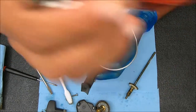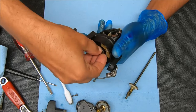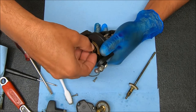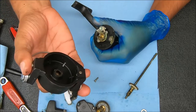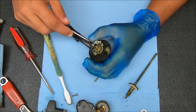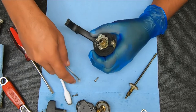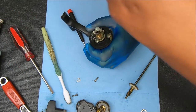Alright, so let's go ahead and remove this rotor and see what's going on under there. Even though I looked at that gear and said it looked alright, you can't always tell — but it did look alright there. So I'm glad I checked. We're gonna pop this off because it can't be this. I'm seeing maybe the leaves were touching this or ripping this too hard — it's not that. So we're gonna pop this off and see if — it's not a leaf system, that's why I'm saying that — see if the bearing is bad, which I'm believing more and more as we go.